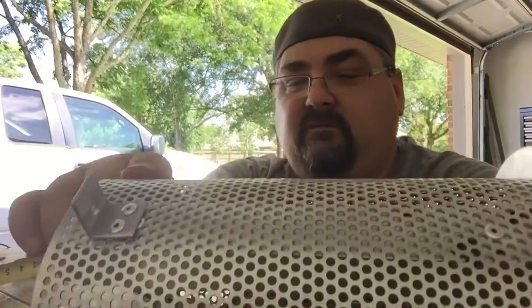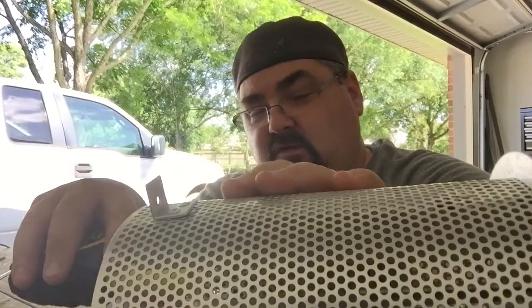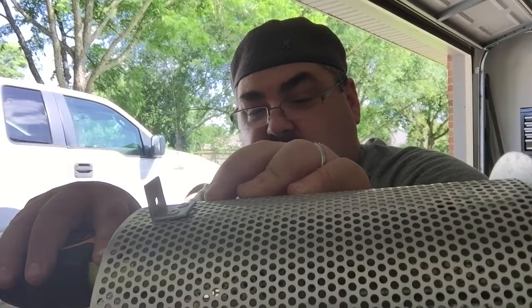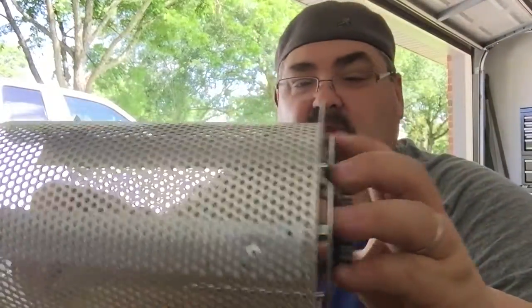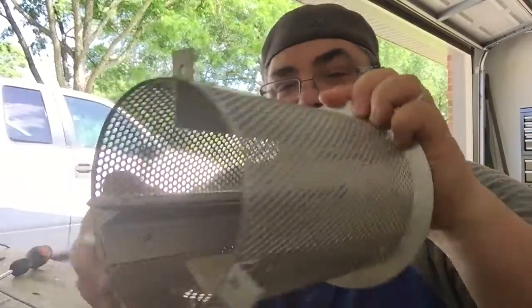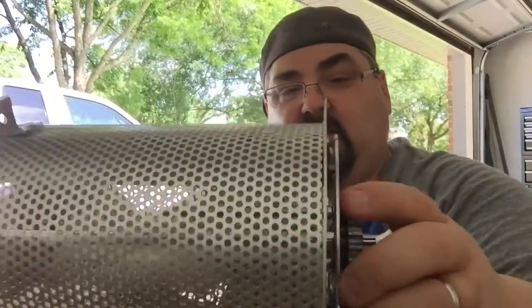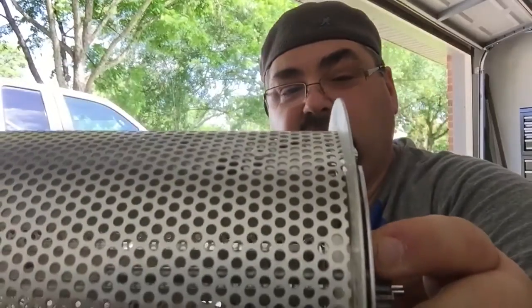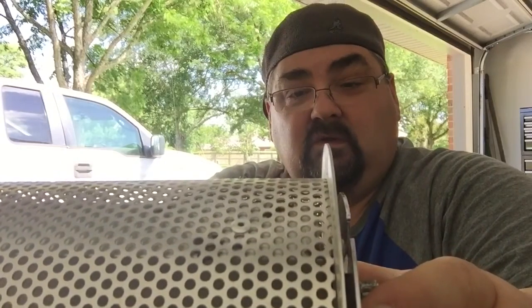I have to take off two rows, but on the top side the two rows amounts to three-eighths of an inch. So what I'm gonna do is drill out all of these rivets, take all three rails off, take off the little angle irons there, and take off three-eighths of an inch off the back side here so that when I reassemble it it will fit in the roaster housing. So let's get right to it.